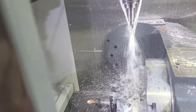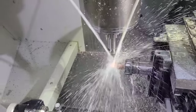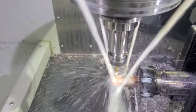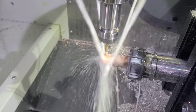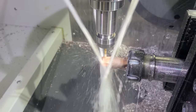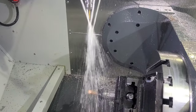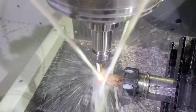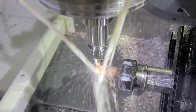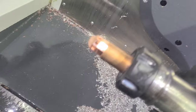We're going to skip ahead here and go down at 90, so you can see it bringing the tool down and making those cuts to drill it. It's going to do that eight times because I'm only drilling to the center of the part. We're going to skip ahead because the drilling is kind of boring and takes a long time. Here's the finished product with all the different holes — it ends up with 10 different holes in it to the center.